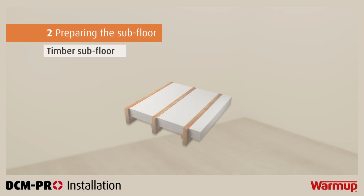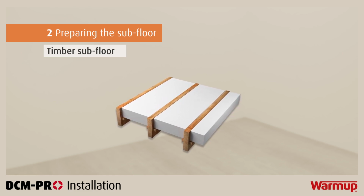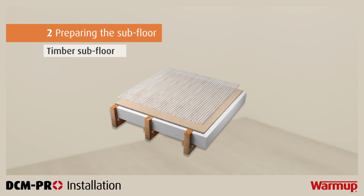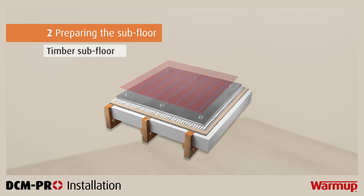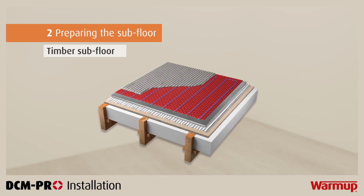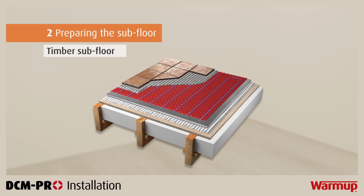For a timber subfloor, the process is slightly different. You should be able to see the following structure in your flooring: insulation between a series of joists, a floor deck, flexible tile adhesive, warm-up insulation boards screwed down, the DCM-PRO mat, your DCM-PRO heating cable, tile adhesive or self-leveling compound, followed by your chosen floor finish. For further information on preparation of timber subfloors for tiling, refer to local tiling standards.